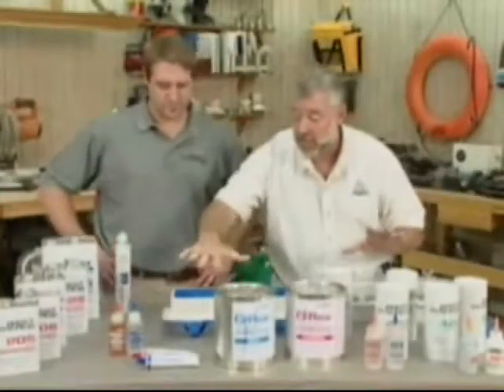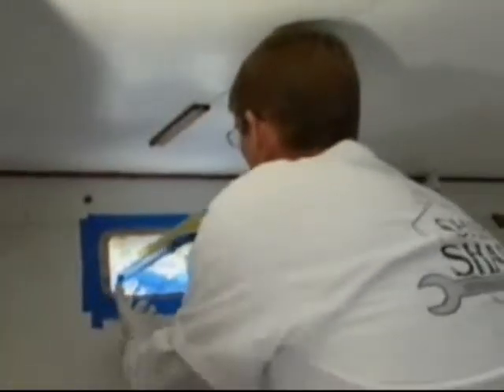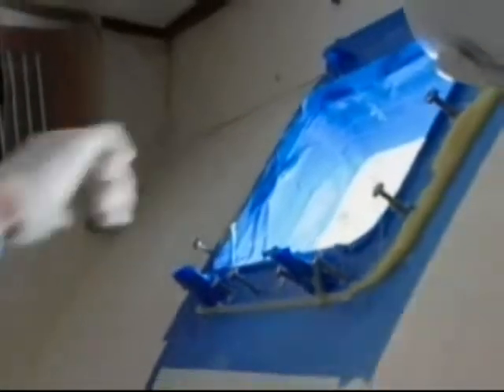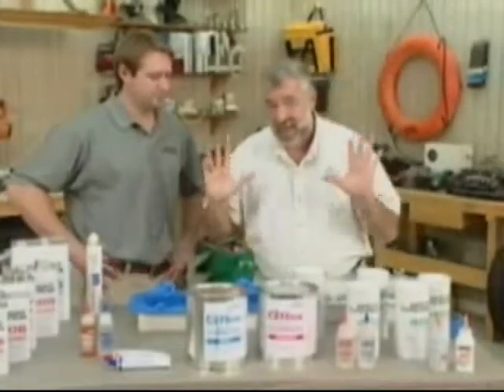What might I do to any type of epoxy to thicken it up? That's where our fillers come in. For this job, I would recommend 406 colloidal silica to mix with the G-Flex. You'll get the strong bond that you need — fold this into the G-Flex and it's going to make it even thicker. We can use this for the structural part of the repair. Once we trowel the thickened material onto our frames and slide it through the boat, on the outside I want to smash it into the gap so everything is in place. We're also going to run in a couple of screws as a temporary clamp to get everything set nice on the inside of the boat, let it cure, and then make some type of fairing compound to blend everything on the outside.